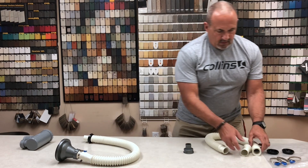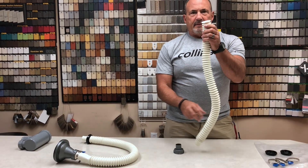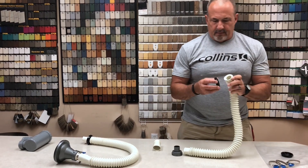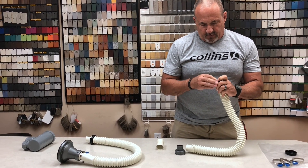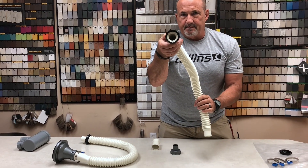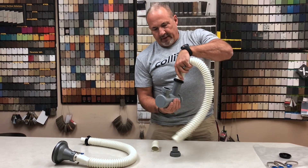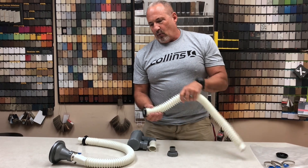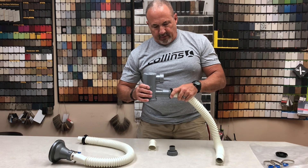Now on the other end, what we have to do is you have to cut it off and you want to cut it off and leave it flanged just like this. Then you're going to work one of your SJ nuts over it and you want to flatten it out on the inside so that it looks like that. Then this end will start on top of your P-trap, your hair trap, or if you just have an adapter — an inch and a half adapter sticking out of the wall — it'll thread onto that piece. Whichever one of those three you have, this will thread directly onto it.